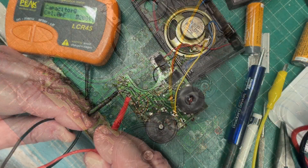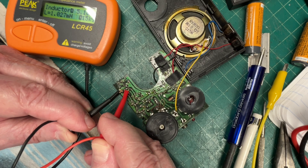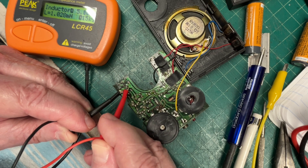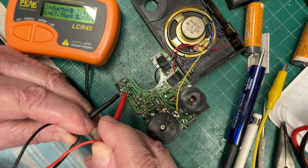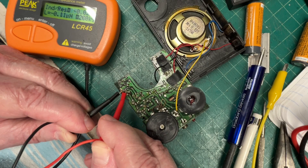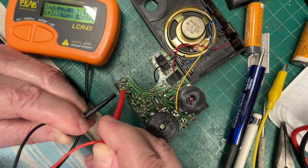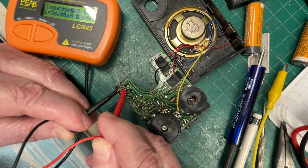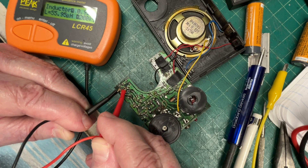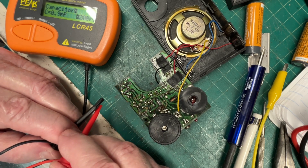Let me see if I can get a clear reading off the meter. All right — one millihenry, 5.16, and then back to center tap I get around 67 to 68 microhenries and a little over one ohm of DC resistance. The secondary, going over to the detector diode: 0.92 ohms and around 56 microhenries.